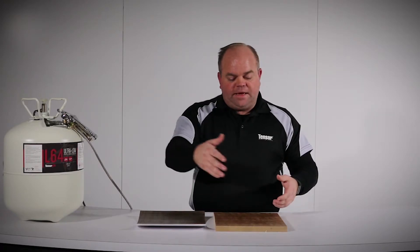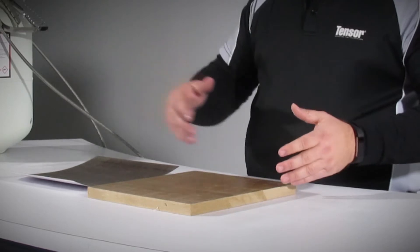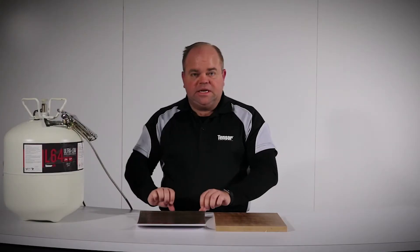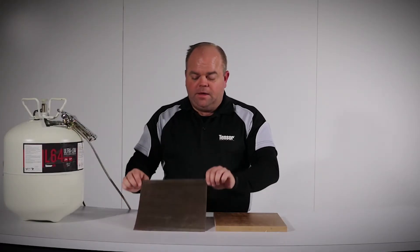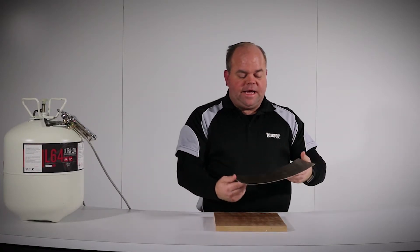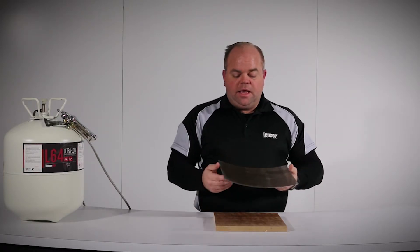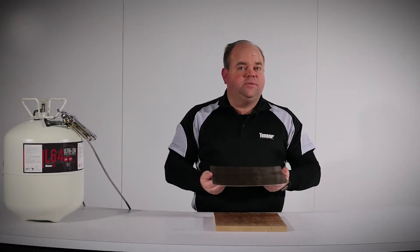To achieve maximum edge strength, you can apply a second coat around the perimeter of the substrates — it's not required. L64 has a quick tack time of three to four minutes and an open time of approximately 20 minutes.